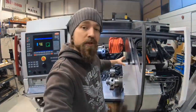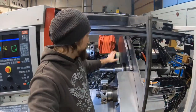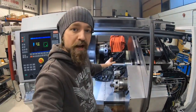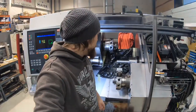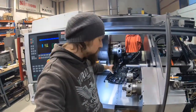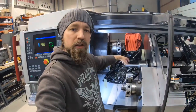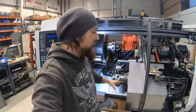We're just going on to the opposite spindle now. Obviously the saw has taken the V-axis off, so now that could be anywhere. So we're going to do a turn test on there, get it nice and square, and then readjust it to bring it up to the centre line of the main spindle. As you can see, we've put a few guards on to try and stop any of the swarf getting in amongst the critical components of the axes. I'll just take you around that and then we'll do a turn test.